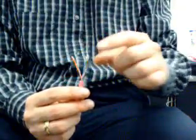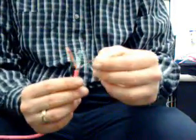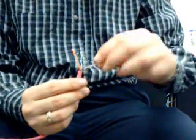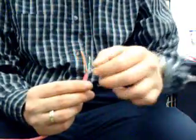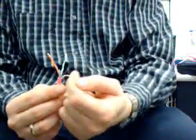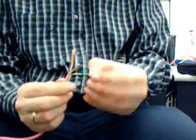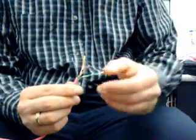Once we do that, we're going to separate the twisted pairs with the orange and white to the left, the brown and white to the right, and then the green and the blue and whites in toward you. Untwist the pairs and then try to straighten them out as best you can. Note the curving action — that's similar to rubbing your dollar bill on the corner of a vending machine to straighten it out. It just makes it a lot easier, but you've got to kind of pinch it really strong.